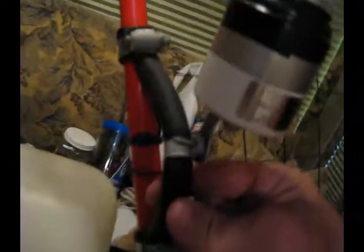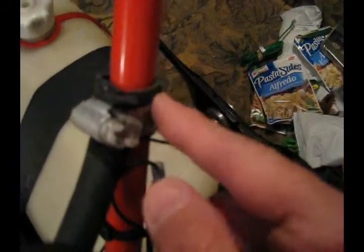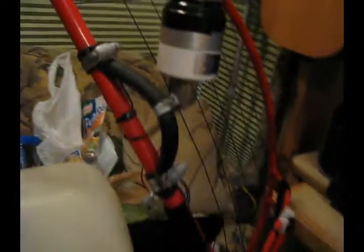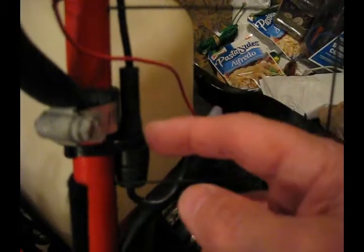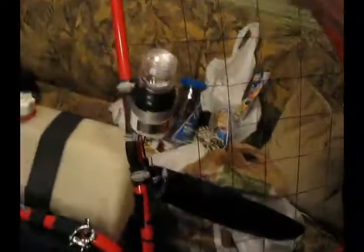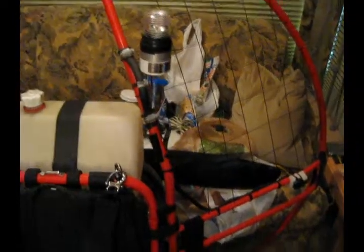So I elected to use some fuel line, and then I use these little clamps and another piece of fuel line to protect the powder coat, and then just hose clamps. This thing gives quite a bit — it just kind of floats there. Worked pretty good; this strobe light is two or three years old and I've never had a problem with it. You've got to place an inline fuse, and I have stake-ons and tie wraps, but the switch is on this one quarter panel of the cage so I don't have to cut tie wraps.